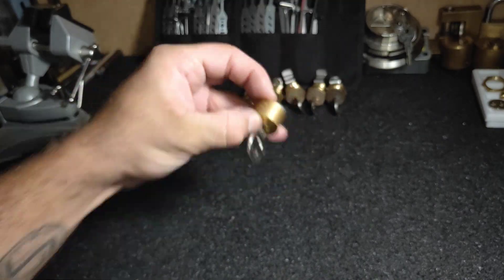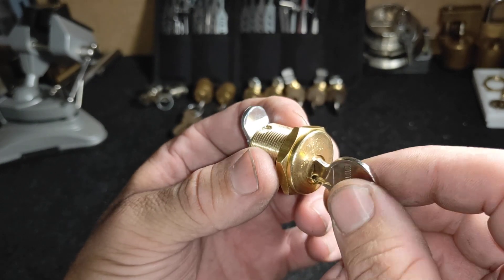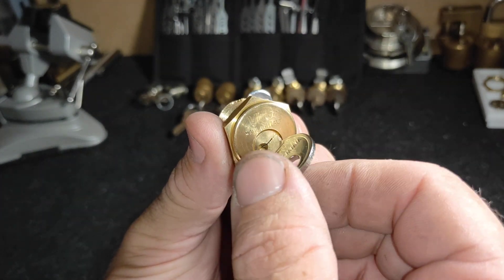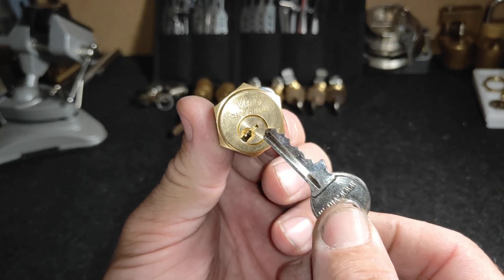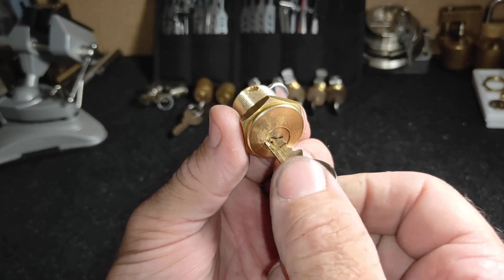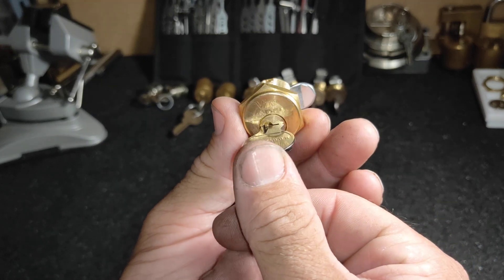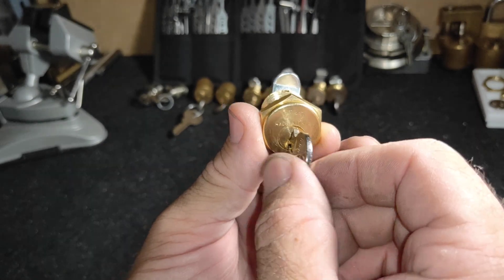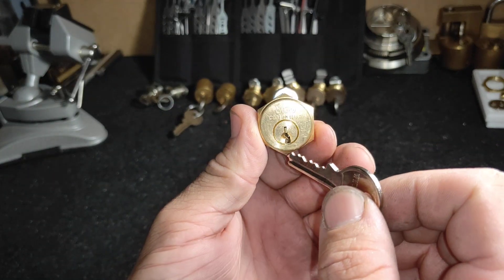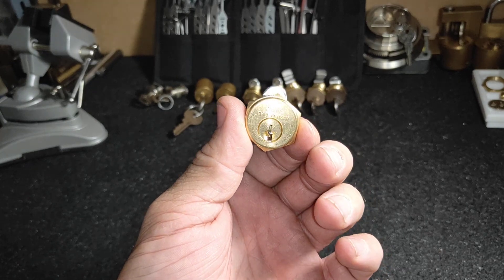It's the little brother of that one, but it was this one that got me curious. If I turn the key to open, I can pull the key straight out - that shouldn't be able to happen, because the way locks work, the key pins hold the key in once it's sideways inside. So it racked my brain, and I thought, why not pull one apart and have a look. I'm going to show you what I found inside - I just thought it was really weird.